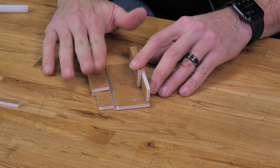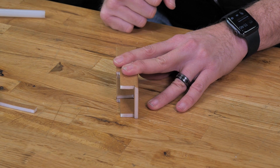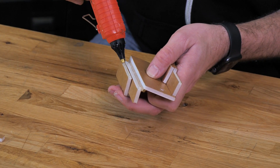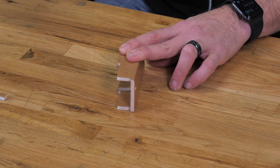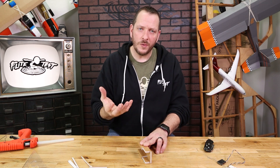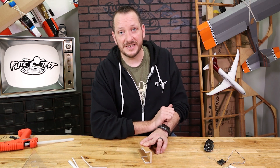We're going to do the same process on the other side. Again, the side plate is against the table. We're going to rotate up the bottom plate, pressing it firmly against the table at 90 degrees, making sure there's no resistance. Glue right on the bottom of the side plates. The side plate goes against the table — press using the table as our friend, nice and firm, hold up to 90 degrees. We can even use our triangle square to make sure everything stays nice and square. Whenever we're doing A-Folds, B-Folds, or even C-Folds, we never want to do that holding it in midair. We always want to use the table as our friend — this gives us nice clean edges and makes sure everything stays true.